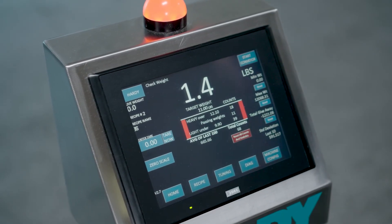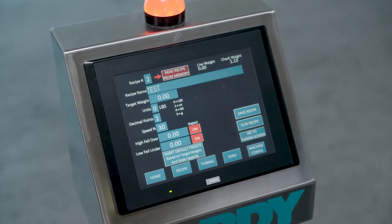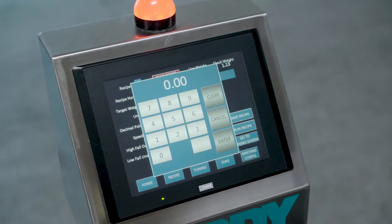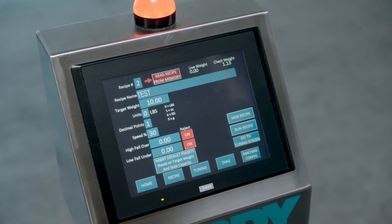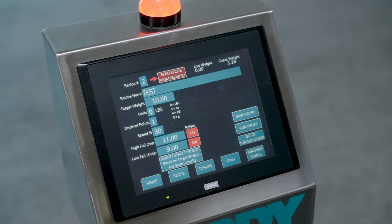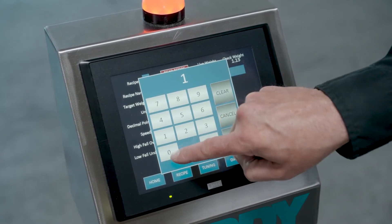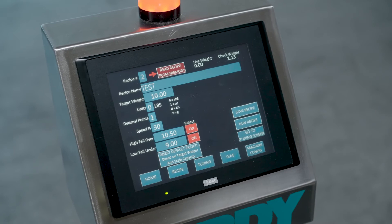Let's talk about the software. Because this machine is PLC-based and built on software instead of firmware, you can change what's shown on the screen and what data is output to your control system. Most checkweighers have something called a recipe. We simplified the recipe setup by automating as many parameters as we can. You enter the target weight — say 10 pounds — then just hit 'Insert Presets.' For example, plus or minus 10%, but you can adjust: if you want the upper limit to be 10.5 pounds, very simple to do. Anything over 10.5 pounds will fail; anything under 9 pounds will fail.